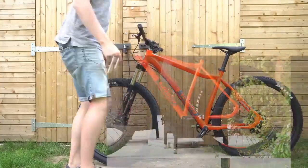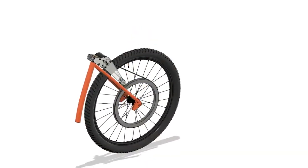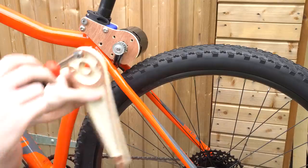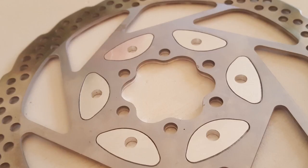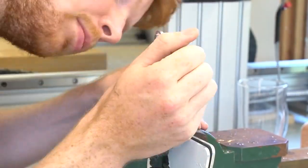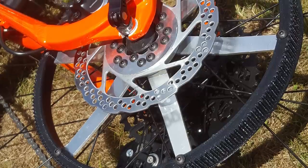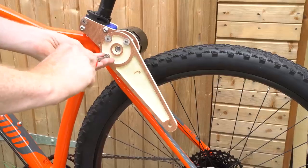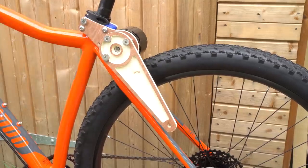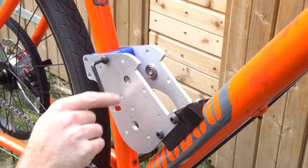To design the new mount, I imported photos from multiple camera angles into my CAD software to produce a 3D model of the bike and design a bracket where the motor could be mounted behind the seat post. I cut a prototype from plywood, then designed the rear pulley — with very little space between the wheel spokes and the brake caliper. The pulley was mounted to the brake disc, with aluminium arms bent to just miss the brake caliper. With a 3D-printed tooth pulley and six spokes, I realized the motor mount needed a full redesign, utilizing the water bottle mounting bolts and a clamp around the seat post to keep the motor protected inside the frame.